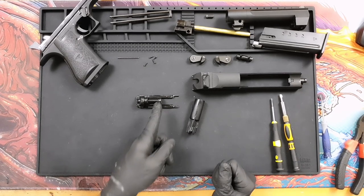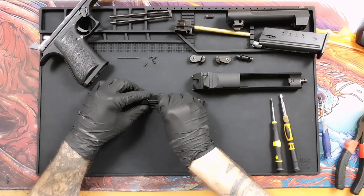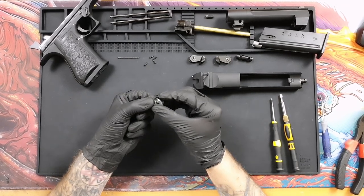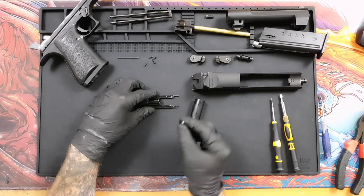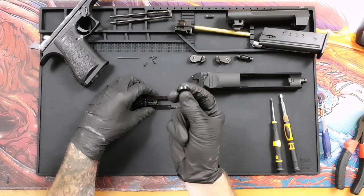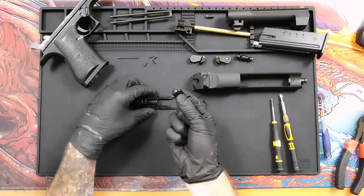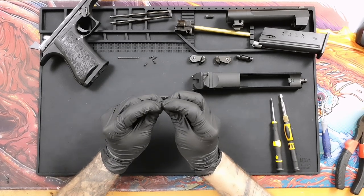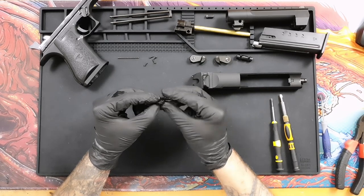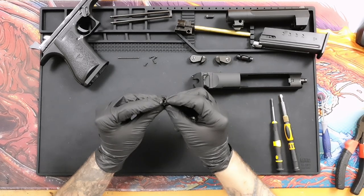This one needs to be rectified. So the only way we're doing that is with a custom O-ring piston type. The best you can do with these cup ones is boil it till it's red hot and then soak it in WD-40 to try and get it to swell as much as possible.